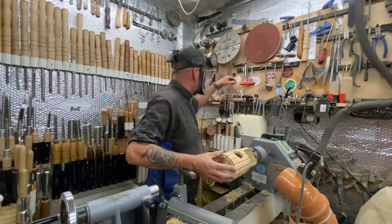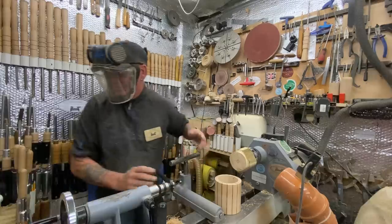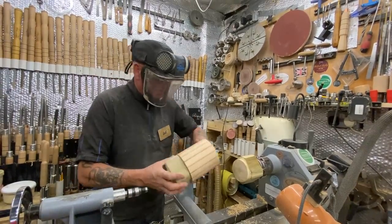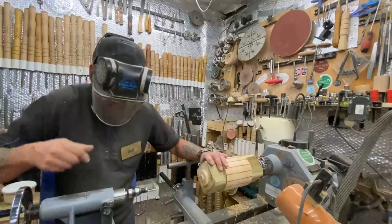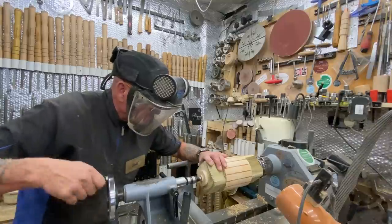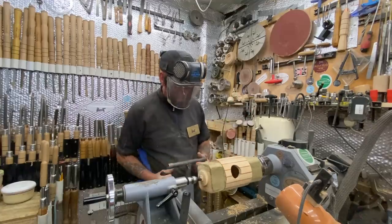I'm going to throw everything all over the place. And we'll do, like I said, this is why I did this. I can show you both ways of doing it. I thought it would be good if I show you both ways of doing it. So I'm going to put that on there, and this time I'm just going to bring my step center up. So if you haven't got one of those chucks, like two chucks, bring your step center up, and there you go, you can do it that way as well. Okay,